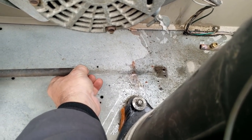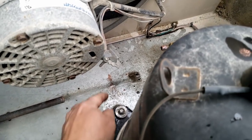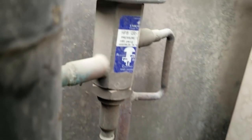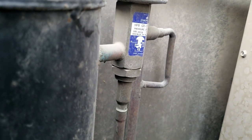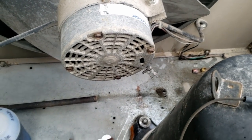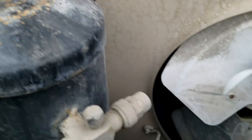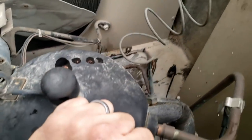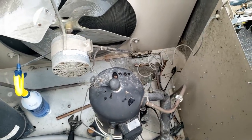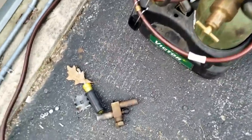The diameter should fit right in — that's likely five-eighths. We're just going to put a little piece in there between the two ends. That headmaster there is 185 pounds, so we'll remember that. Definitely don't want to get shavings or debris inside that headmaster or any other components. That's one of my little shortcuts — I don't mind using a saw as long as you use a pipe cutter at a different location so you don't get shavings into the system.